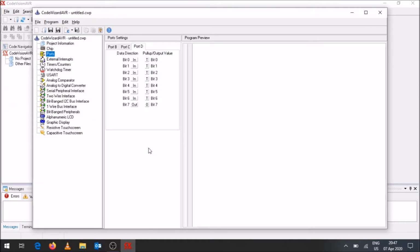Okay, I know it's not the most peaceful example, but it is one that has the most drastic effect in my mind, and now I can always remember these types of things. We've got other pins as well that are outputs, specifically on port B, pin 2 and pin 3. Those are PWM outputs. I'm not going to indicate any outputs on port B for now, and you'll see a reason why. And then we've got an analog to digital input, which is on analog to digital converter 0.